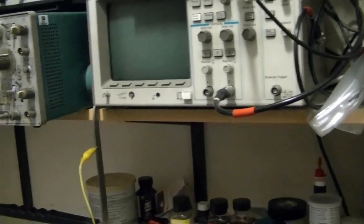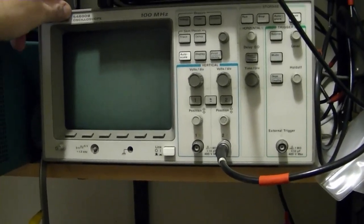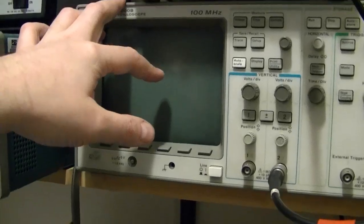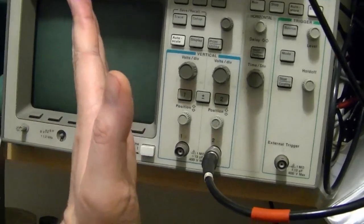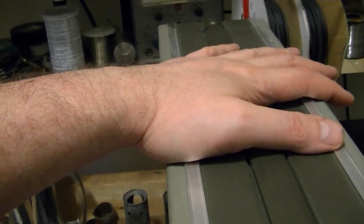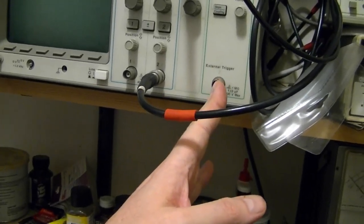One is the actual marker signal can distort the response curve. And two, the markers typically are in the vertical axis, and if you want to do a marker on, say, the rise or fall of a response, it can be pretty hard to see. So what this does is they modulate the Z such that right where you hit the marker, the Z goes from low to high.